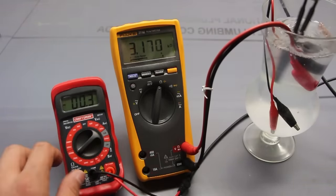All right, let me run through again what's happening. I have current traveling through that top black probe. This guy right here is traveling through here. It's going to my multimeter, which is currently set at 10 amps. And because we're measuring current, I have it in the gray one, which I showed earlier, that must be connected when you're measuring at 10 amps. And it's AC 10 amps.